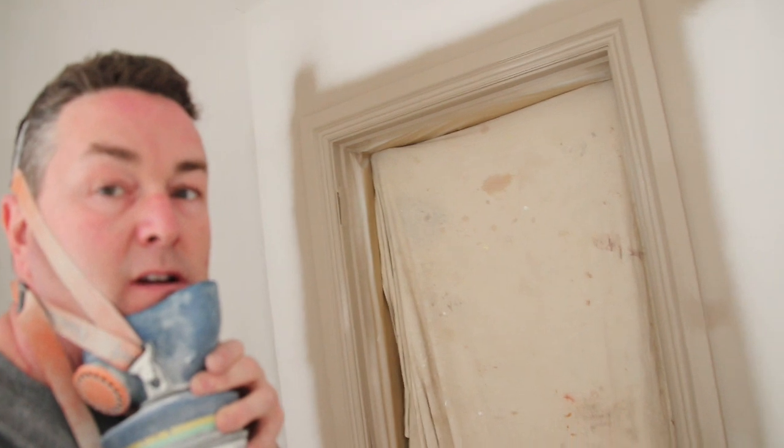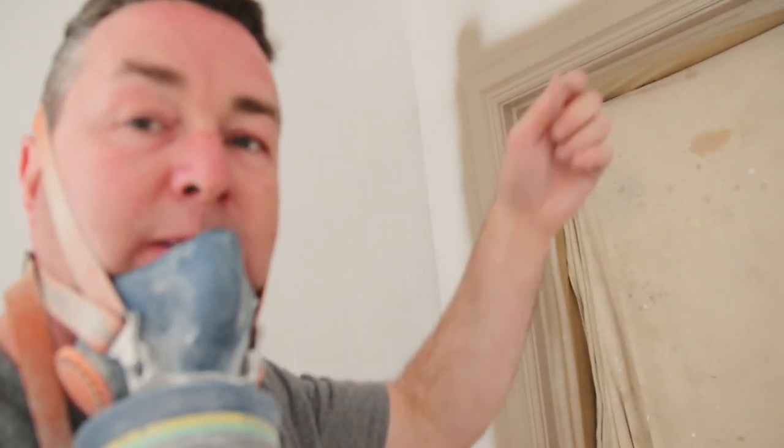And then got the woodwork there. So I think you get the principle of what I'm doing, don't you? Keeping it flowing, paint not too thick, not too thin, and you can get it right. And technique is straight up and round, don't stop on yourself, particularly on frames.